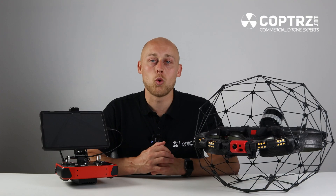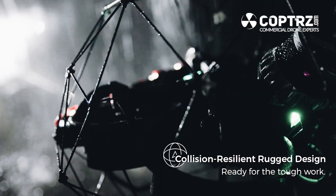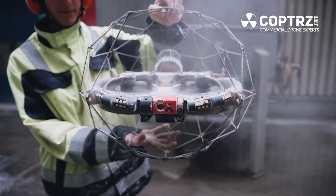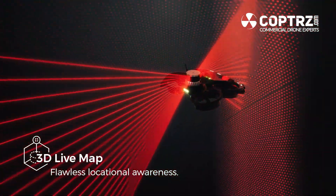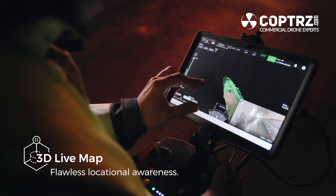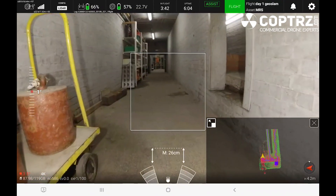Building on from the Elios 1 and 2, the Elios 3 is now built to the IP rating of 44. This allows you to inspect and investigate more hostile and dangerous environments while still boasting that great sensor quality of the 4K camera on the front. Once the Elios 3 is armed, the LiDAR scan on the back of the drone is continuously spinning. This allows the drone pilot to have a live 3D model of where the drone is in its environment. When flying, this gives you a full understanding of where you've been, where you're going, and how to get back home within the quickest point possible.